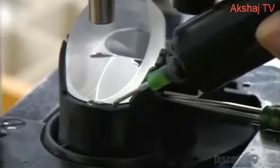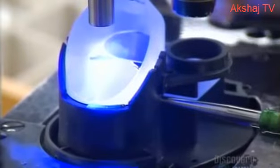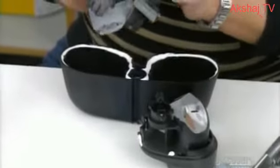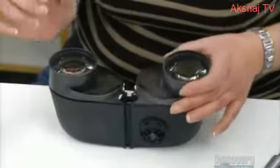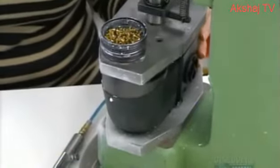This optical machine aligns the focal points of the prism and its corresponding objective. Then some more glue to lock in the positioning, and a blast of UV light to dry the glue. Now they silicone the objectives and prisms to the housing's middle section. Silicone creates an airtight and waterproof seal. A holding mechanism presses the parts together while workers drive in the screws.